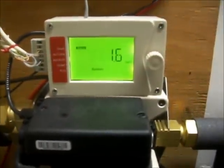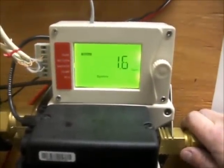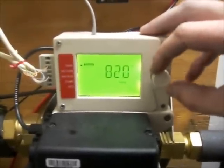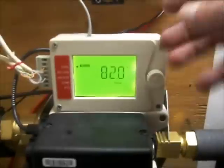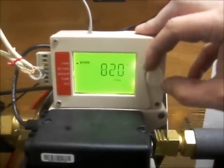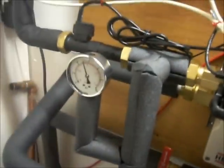The highest I've seen is about 3.5 gallons per minute. In full sun, the collector temperature won't get totally extreme — it'll just keep ramping up the speed of the fluid running through the collectors. We're running at about 13 pounds of pressure and it doesn't look like it's going to get much higher than that.